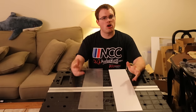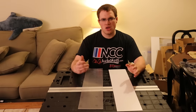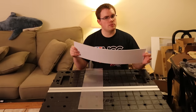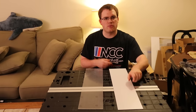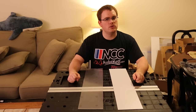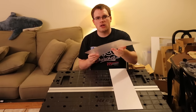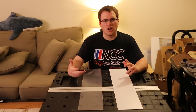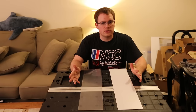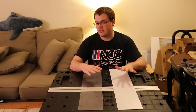The types of plastics used in vacuum forming are called thermoplastics, which become pliable above a specific temperature and then solidify again upon cooling. The common types are PETG, polystyrene, and ABS. Polystyrene is an opaque plastic available in multiple colors, most commonly white, and is the most common type for the vacuum forming hobbyist. Deformation occurs around 250 degrees Fahrenheit, but a heating element capable of 300 degrees is best. PETG is a clear plastic shipped with a protective film, most commonly used for visors or RC cockpits and also used in manufacturing plastic bottles. It can be colored or tinted, and it deforms faster than polystyrene — in my use, about half the time of polystyrene given the same thickness.